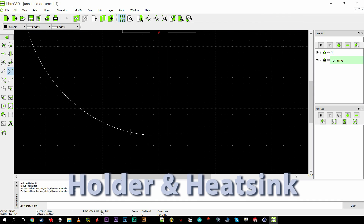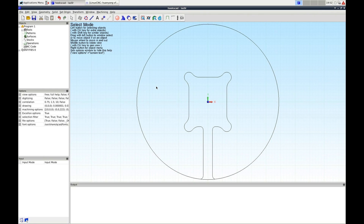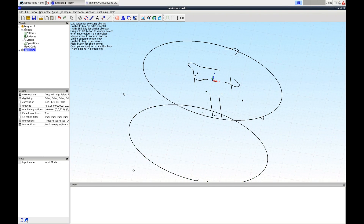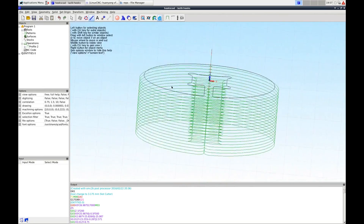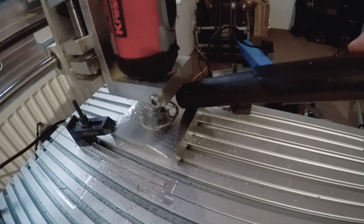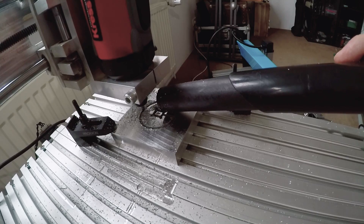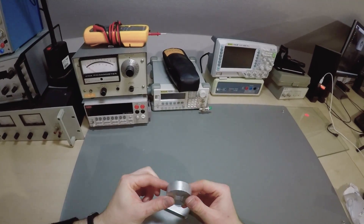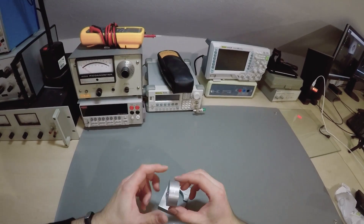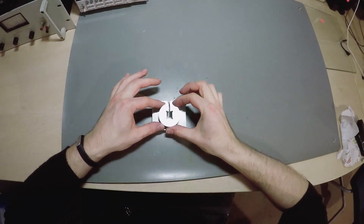This particular laser from lasertech.com already has some threaded holes in it for mounting and heat sinking, but because heat directly affects the lifespan of the laser diode, I really want to go to town with this and make a custom part. Had to fight some weirdness in the CAM software along the way, but ultimately it worked out. I'm going to mill that out of solid aluminum stock so it can be used for clamping and heatsinking. I only had a vacuum for chip extraction, so I was re-cutting chips all the time, and that left a mediocre surface finish at best. But I got the dimensions right on the first try and I'm happy with the results.